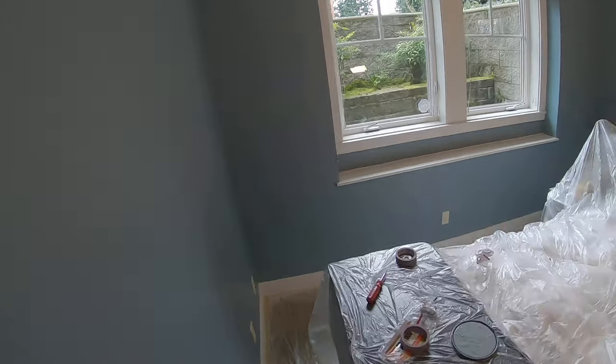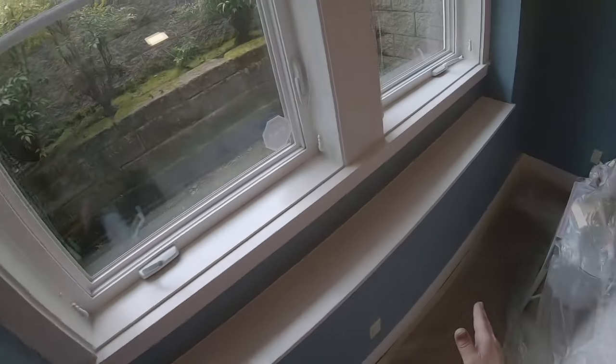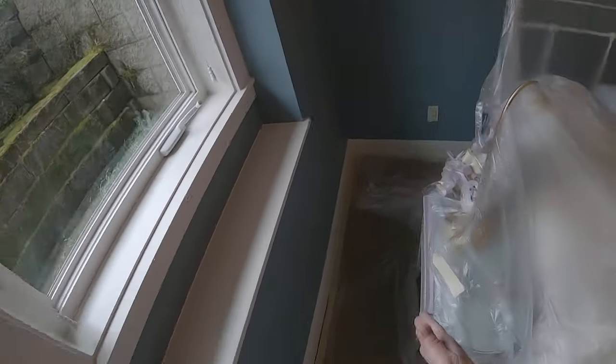But if the paint is super dry, the tape will just pull easier. You won't get any sheeting. Sometimes you can get sheeting problems when you go to pull it. And this paint, because it's not quite dry, will sheet off. So you want to make sure that it's nice and solid and dry. So I'd really recommend waiting. But you can see with the wide angle, I don't know how well you can see it.